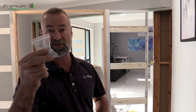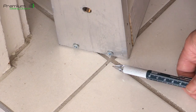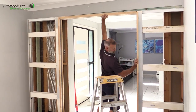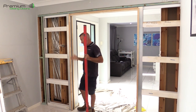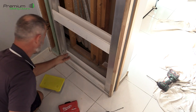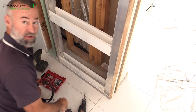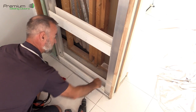Now this is the fun part — trying to screw it all together in place. The pan heads are for the top of the door, four for each bracket. Before I screw those right off I'm going to slide the other roller in the end of the track. The countersunk screws go on the bottom of the unit and the same up top. The main thing you need to make sure is that the stiles are both plumb and level. I'm going to utilize the hole in the back of the frame with a 14-gauge batten screw, putting some packers behind so it doesn't over-tighten, and then pin the bottom section down into the concrete with a very flat pan head screw so it doesn't protrude and scuff the door.